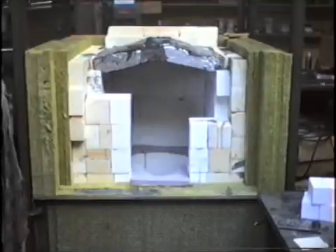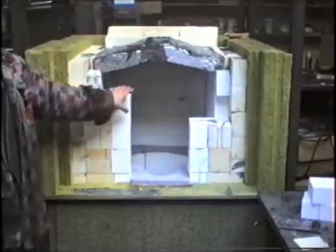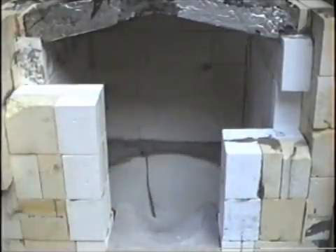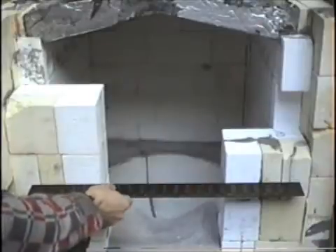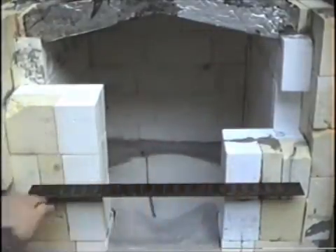Now that work is basically finished on the inside of the chamber, I'm bricking in the entrance — filling up this region on either side of the door. Because the door closes against these two surfaces, it's very important that they're completely parallel. So when I'm cementing them in place, I'm holding this square up here to make sure these areas are nice and tight and in the same parallel line.